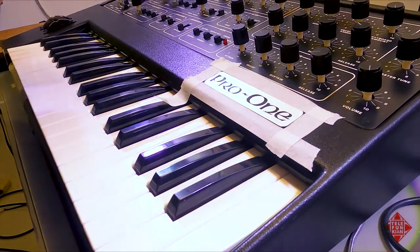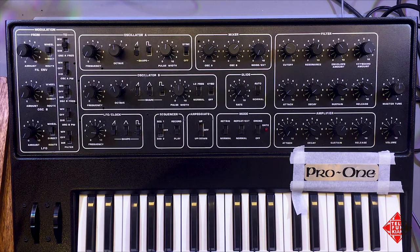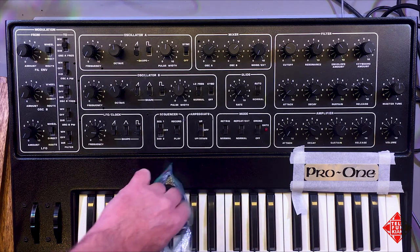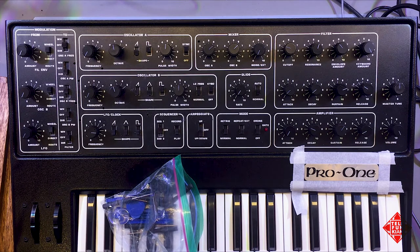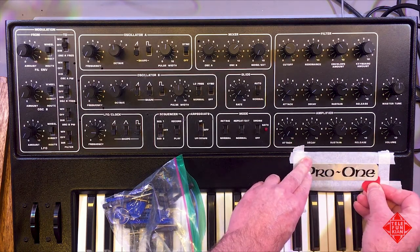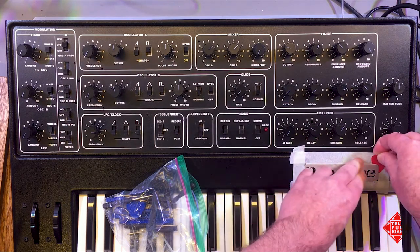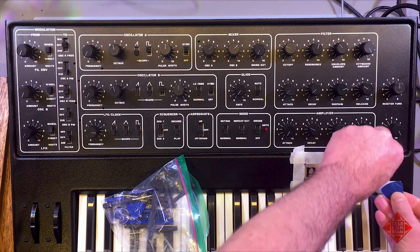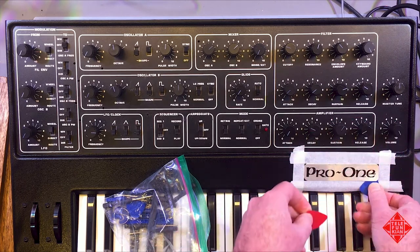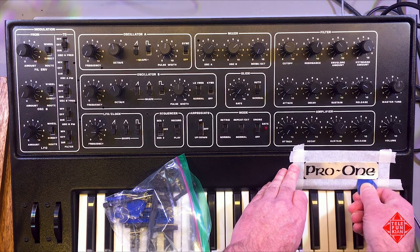Now, usually the best thing to use when attempting to remove metal from plastic is plastic. And I have a number of plastic tools that I've held on to that are designed for taking apart cell phones and the like. And they include these little devices, which are almost like guitar picks, which are great for getting underneath a flat surface and separating materials that are held on by various types of adhesives. So it does indeed look like this is doing the trick. Could be expedited by using a little heat, such as from a hairdryer or even a hot air station.